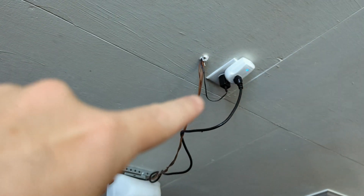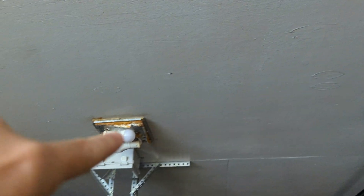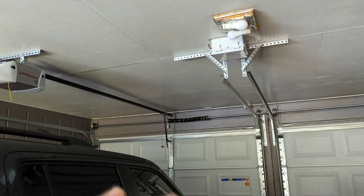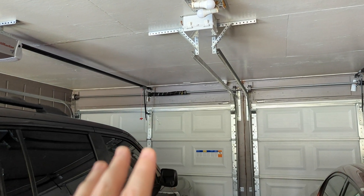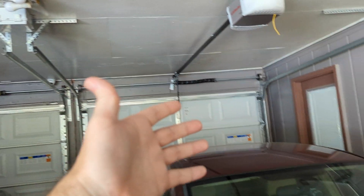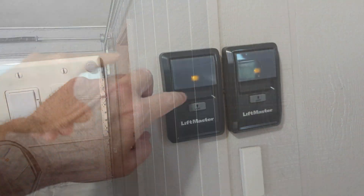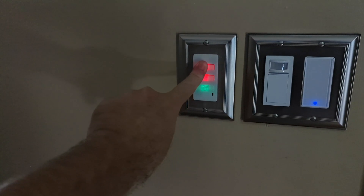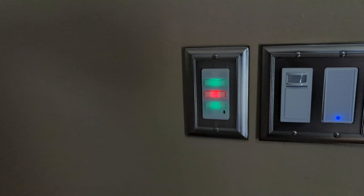This is just a simple 1-amp 5-volt power supply that runs over to the project box. Since it just adds that little door opener on top of things, you're not voiding any warranties or removing any functionality — you're adding functionality. I still have my keypad on the outside, the regular keypads in the laundry room, plus a multi-status sensor so I can see and open from the living room. We can also do phone notifications.